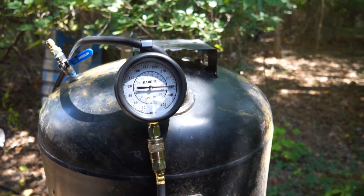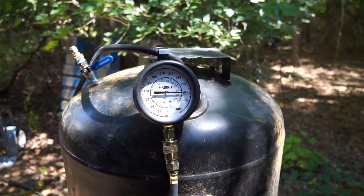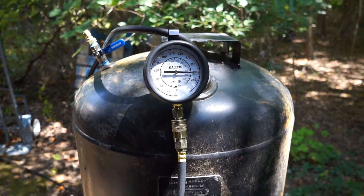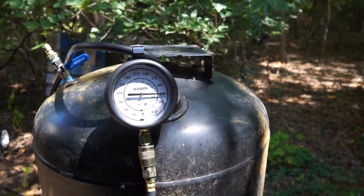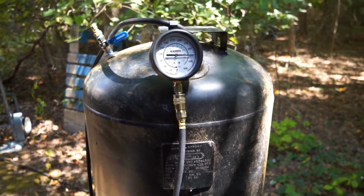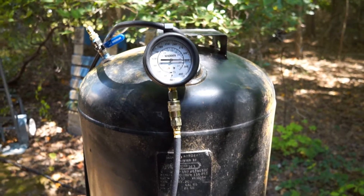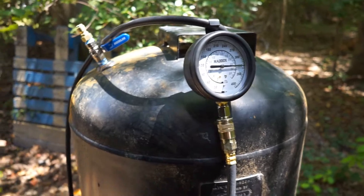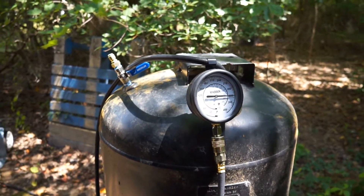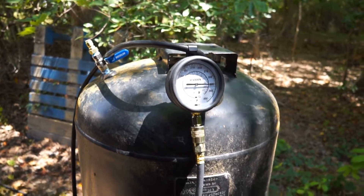Just a quick update — it is about 21 hours later. If you take a look, there's no evidence of any leaking or anything. The pressure's dropped about 20 PSI. I'm pretty sure that's because it's been significantly cooler — probably about 15 degrees cooler most of the day — and the water in the tank is just cooler, which lowers the pressure. I'm really happy with that. I'd say this is pressure tested to 350 PSI, or at least 330 PSI. At 350, that covers a two-times factor for about 175 PSI, so I think this could be safe for running as an auxiliary tank for the 150-pound compressor. I think we're good.